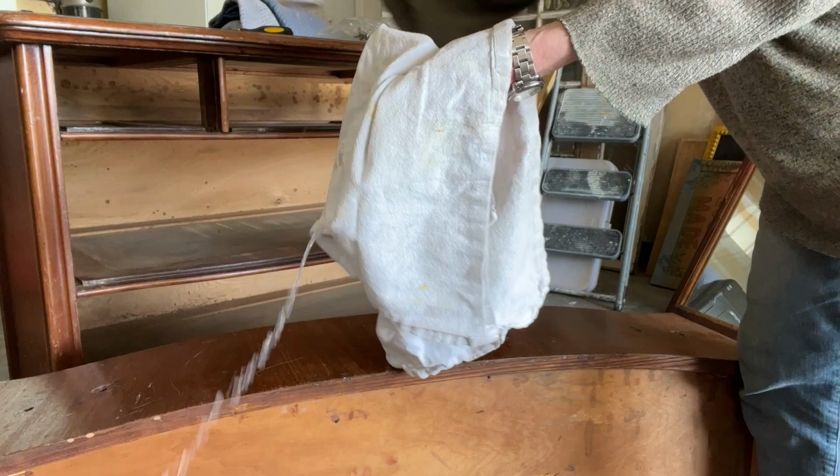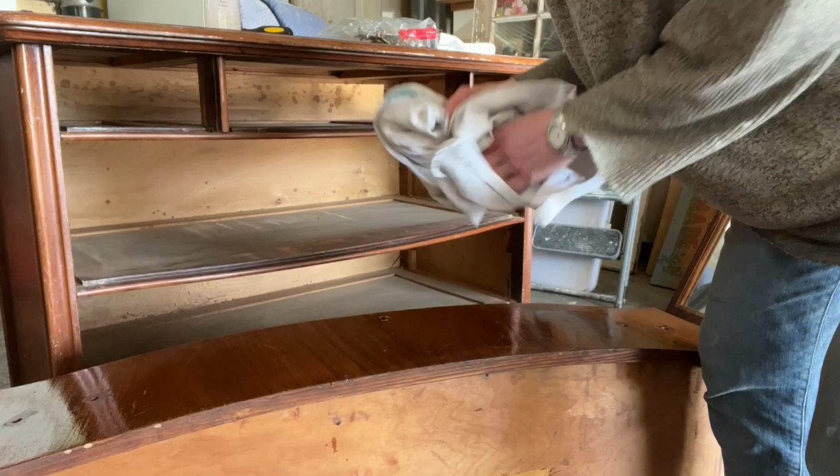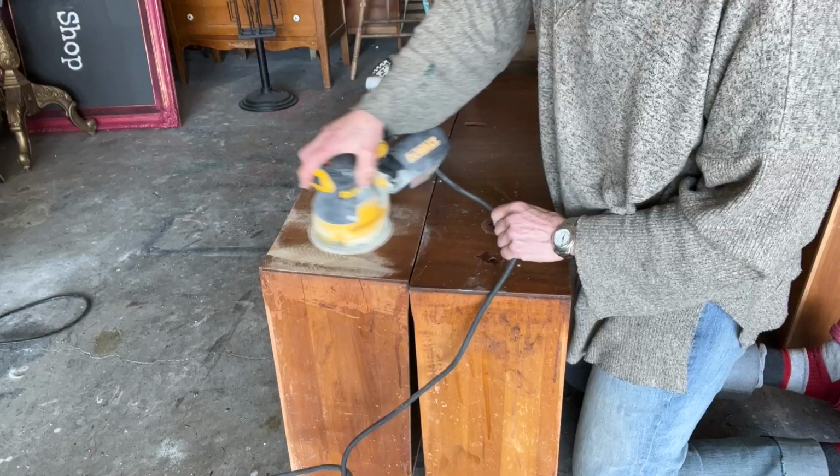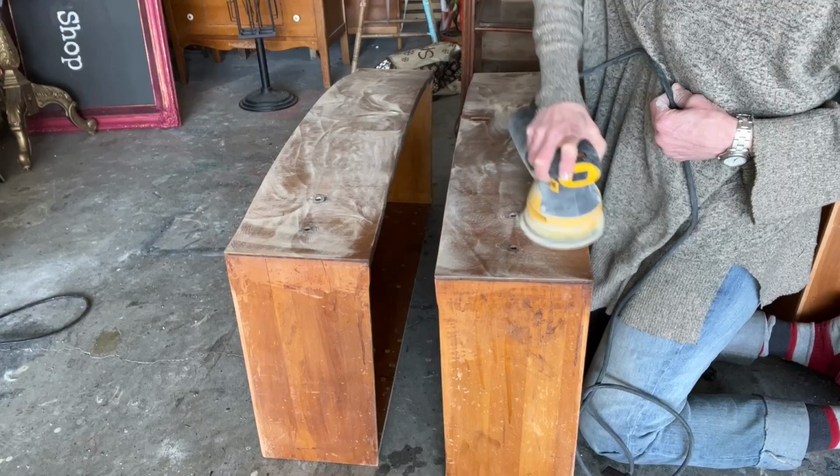I'm using a mixture of Humble Suds. I'll leave a link below. I love this all natural cleaner. Finally, ready to sand. There are some deep scratches in this and I want to get that veneer smooth. So I'm starting with a 120 grit and I will finish with a 320 grit.